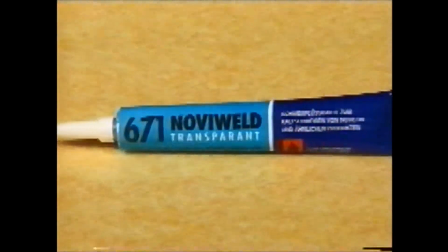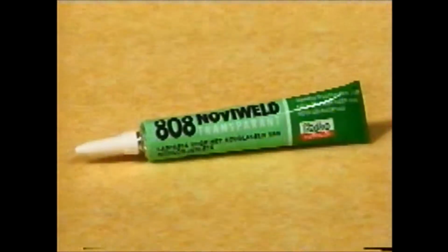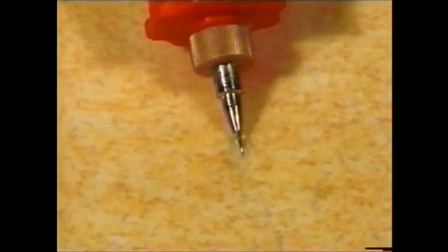The seams may be butted, cold welded, or heat welded. Welding is to be done 24 hours after laying. In the majority of residential premises with a U2S or P2 classification and an E1 water resistance rating, the seams do not require welding. For some E1 or E2 rated premises, cold welding is adequate.